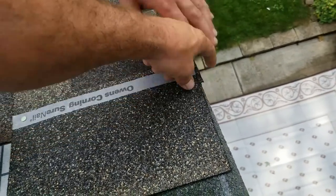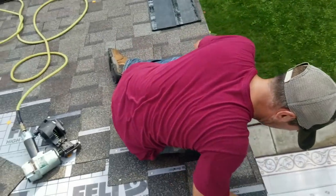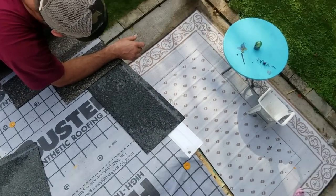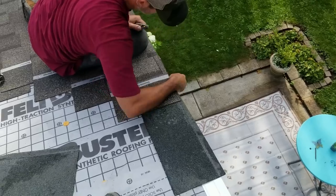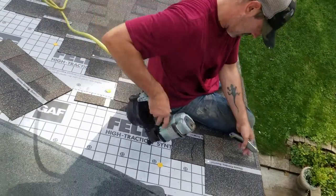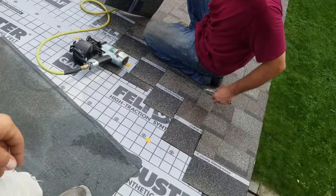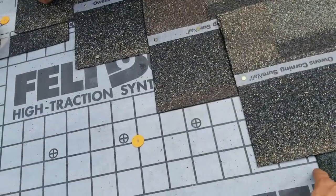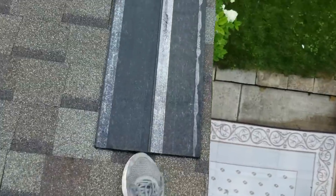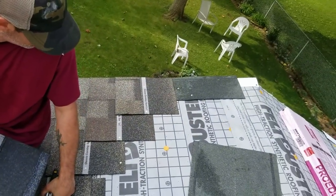You managed — that's not too bad but the other one's gonna cover it. Well, it hangs off the edge so if you look up from the bottom you'll be able to see that little edging. You overhang your drip edge a little too tight — it's a little too tall. Main thing: Brad is trainable. I wouldn't add one more to that — normally you want your last piece about the length of the starter. Yeah, you're good with that. We'll get you to practice that.